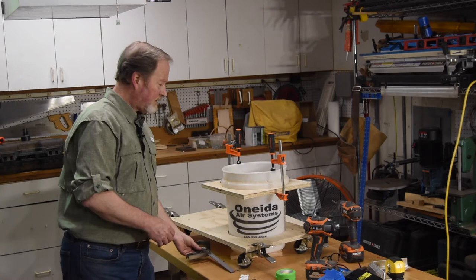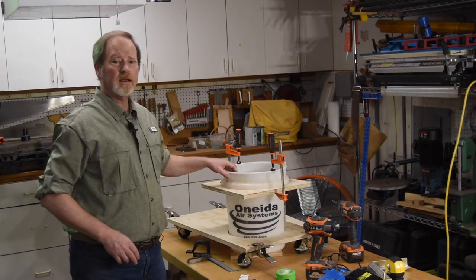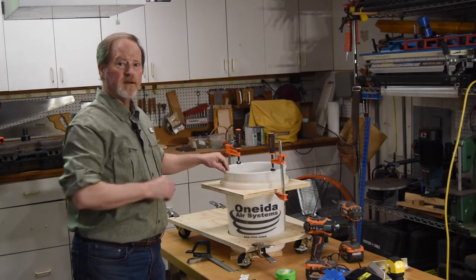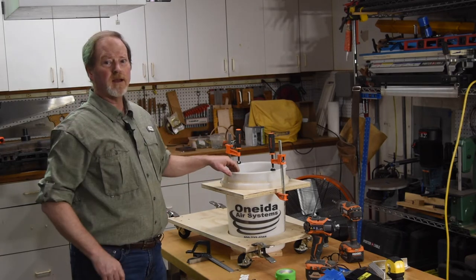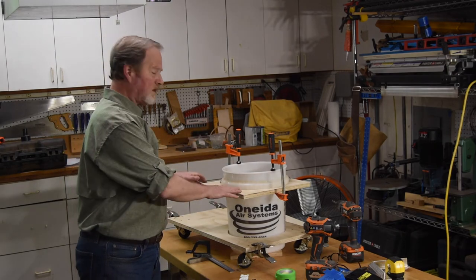I will go ahead and take out of my scrap or extra plywood. I'm going to cut a plate right here. That'll give it the real support. And that'll be what supports the bucket. And I will screw this to my side plates, and that's fine. But I don't want the screws to support that action and shear. That's never a good situation. So we'll get that done first.